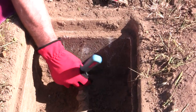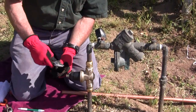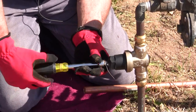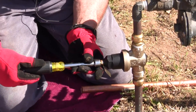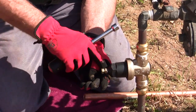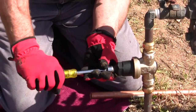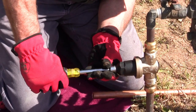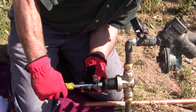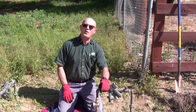This pressure regulator valve comes pre-adjusted from the factory at 55 PSI, but we're going to give the yard pressure a little bit more. I can use this nut driver here. The adjustment nut on a regulator appears to be backwards — it isn't though. To turn the pressure up you tighten the bolt down. It'll come with a lock nut, so first you loosen the lock nut, then start to tighten that bolt down to raise the pressure. It came at 55 and it's climbing up — we're going to take this one up to about 75 or 80.